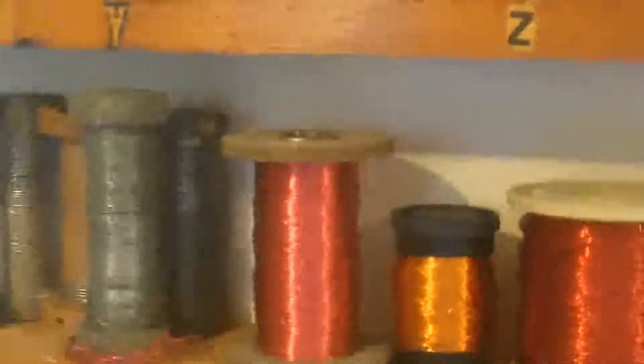That's one of the smallest wires I've got. The finest one I've got is this Litz wire, and I don't really want to waste it on this. It's very, very fine stuff — 0.04 mm, and that's seven strands, each 0.04 mm. So very, very fine, and I'd probably break it winding it.